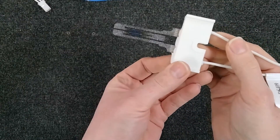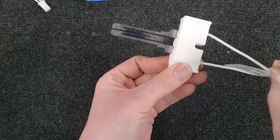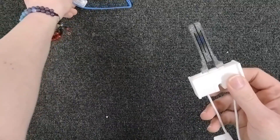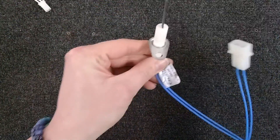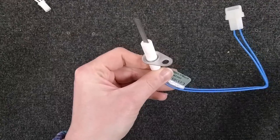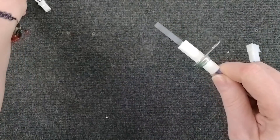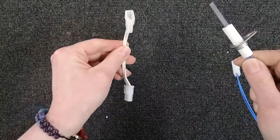Because of these issues, a lot of manufacturers have caught on to the flaws of this design — how fragile it is and how quickly it breaks. Carrier caught on and a few years later — 10 to 15 years or so — they actually replaced this igniter with a retrofit kit. It comes with a more durable silicon nitride, and they just give you an adapter to plug it right back in.